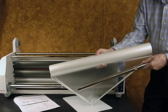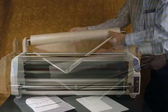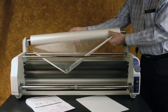Remove the top mandrel from the laminator. In the center of the mandrel, there are mounted two metal points. Take a roll of laminating film that has the dull adhesive side facing away from the heat shoe and put the film roll on the mandrel. Center it. Note: if the rolls you are using have the dull adhesive side in, then the top metal point on the mandrel should be facing the operator and the film should be coming off the roll traveling down. Now place the mandrel back onto the laminator.